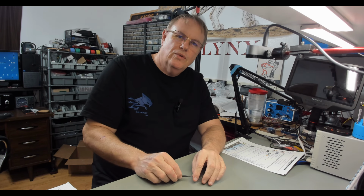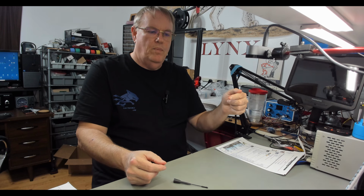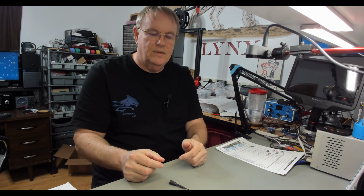And so I cranked it down. We laid it down just low enough I could get to the bottom of the antenna. The nut had backed off and the bolt had come out, but it had just regular nuts on it. So that's a suggestion I'll give you. If your pin bolt through the bottom of the hub that goes on your rotator doesn't have an elastic lock nut on it, go get elastic lock nuts. Don't use split washers and a nut. Save yourself some aggravation.